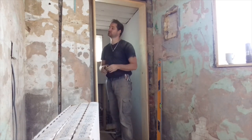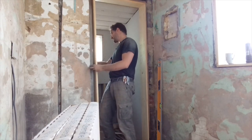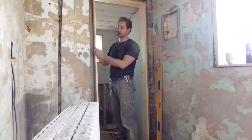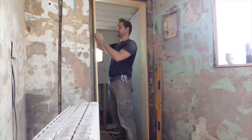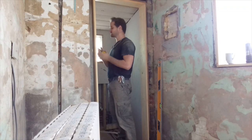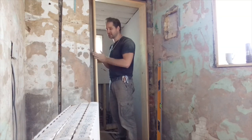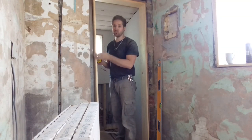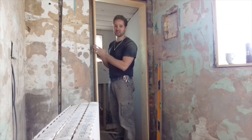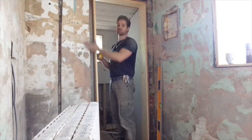To actually know what sort of size material you want, you measure the wall. You go, oh yes, that's a four and a half wall, five and a half, or whatever thickness. Mine is shy of five and a half, so the material I wanted is just a little bit bigger. Mine is actually 14 and a half centimeters, which is just the right size. You've just got that little bit of overlap, because if it's completely the same thickness as the wall, when you come to do your plaster you will have a weird gap when you do your architrave and this won't look right. So you've got to make sure your door lining is a little bit thicker than the wall at its current state, because when you do your plastering you plaster it nice and smooth so that it's seamless.